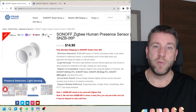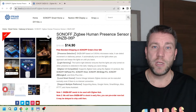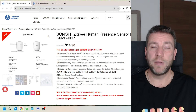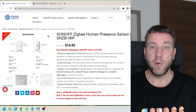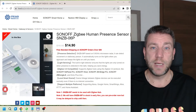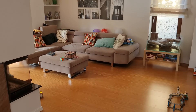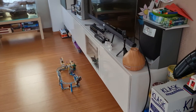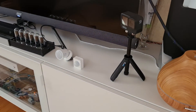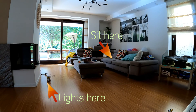Mounting sensors on the ceiling looking down could be a better option for a longer corridor to properly detect motion. Finally, I moved to my living room and placed both sensors next to each other along with the GoPro. The sensors are looking into the living room, and for the testing I was sitting on the couch about five meters or 16 feet away from both sensors.